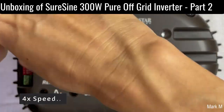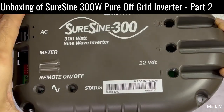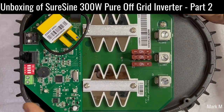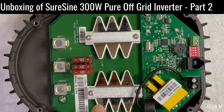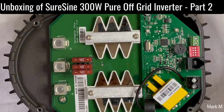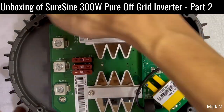It's going to open — okay, it's just a cover. Pretty nice — we have aluminum fins. Let's twist to get a good view. We have the heat sink. This is made in Taiwan, just like Apple — designed in the US but manufactured in Taiwan. We have the circuitry, the fins for the heat sink, and also the terminal lugs, which accommodate 6 AWG.